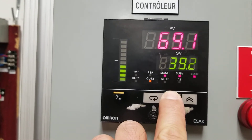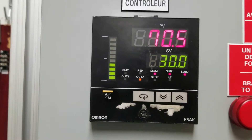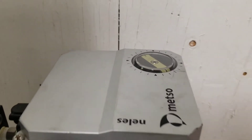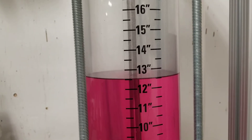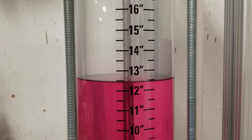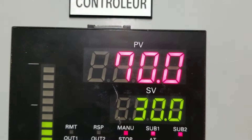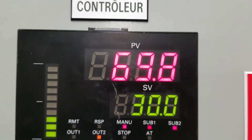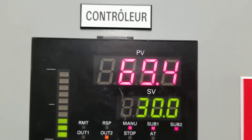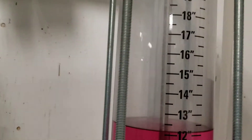So I'm going to lower it — it's at 30 now. You heard the valve there readjust. It's open about 30%. The liquid is fairly stable, going down a little bit, very slowly. As you can tell up here, your PV — so it's dropping. And that 70% is 70% fill of what the old zero and span numbers are. So 30% seems like a pretty good number for this station.